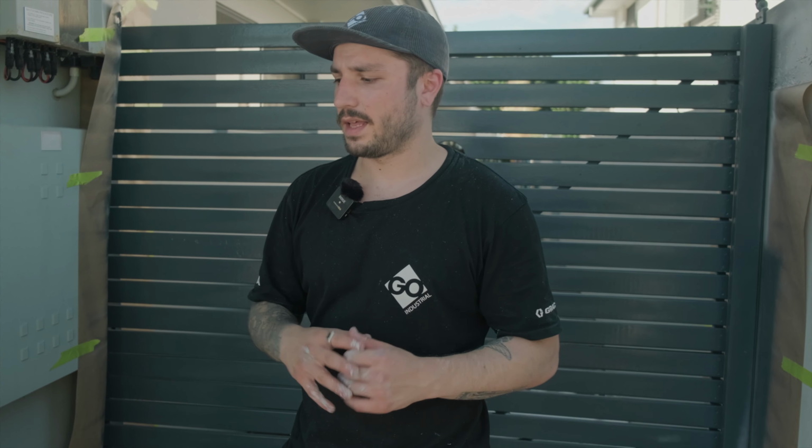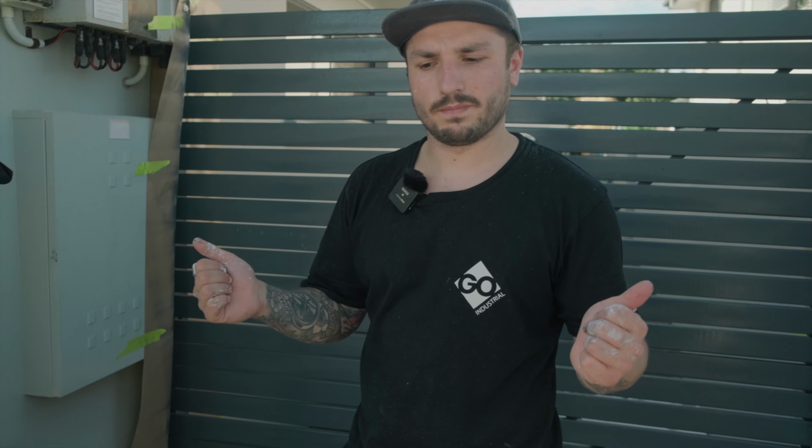It's a really hot day today. It's about 36 degrees. It has a dry off time of about 30 minutes. So we'll keep checking it probably after about 15 minutes. We'll check it every 5 minutes. And as soon as it's not tacky anymore, we'll hit that second coat and then pack up, go home, swim in the pool, drink a beer, relax. Let's go.